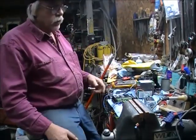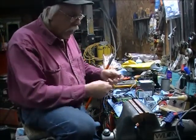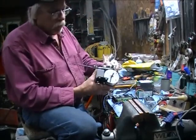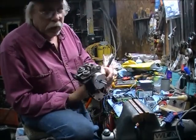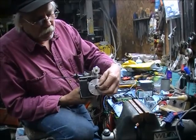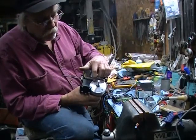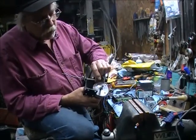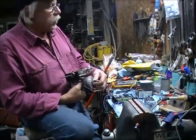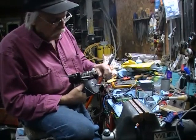It was right here inside the board, but that wasn't going to be very handy for me. I wanted to put a knob on it, put this box inside the cover and mount the motor. I took the motor off and machined this piece of aluminum up right here. This aluminum piece has got two bearings inserted in it. I had to take the shaft out and machine it down to eight millimeters — the same size as the motor shaft. There are four screw holes here with little tubes, and I'm waiting on a little eight-millimeter-to-eight-millimeter coupling before I can put this together.